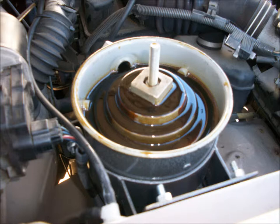Remove the heated lid using a rag or a glove. This lid on the refiner canister is an electrically heated lid, and it gets up to about 240 degrees, which isn't enough to actually burn your skin, but you wouldn't want to hold on to it very long.